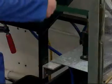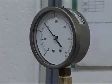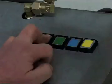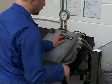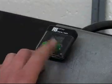Hydrostatic testing is carried out in a purpose-made test rig and comprises a pressure test of the valve body and seals in the open mode, followed by repeat tests in the closed mode, in both the flow and reverse flow direction. Water pressure is maintained in all cases to a specific time and must remain constant for the allocated period.